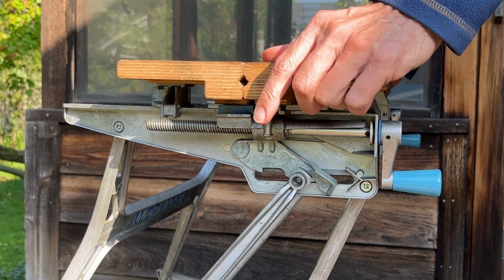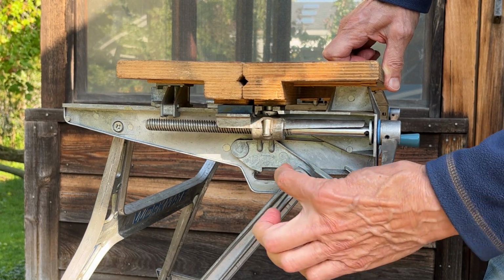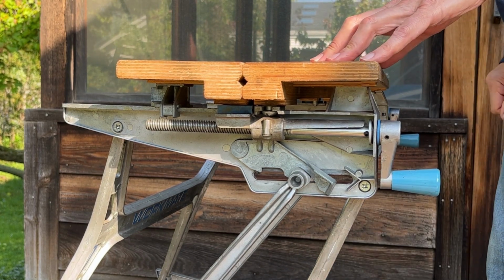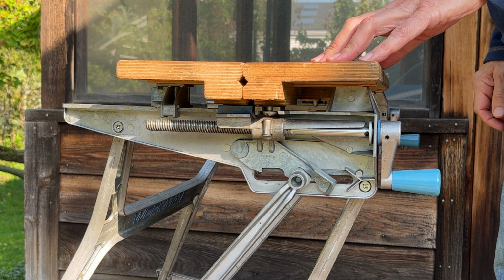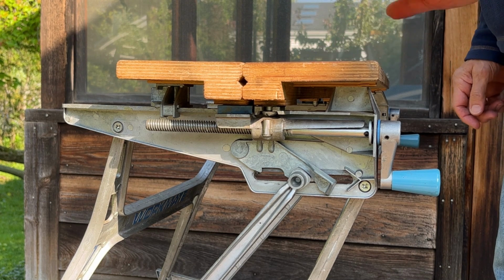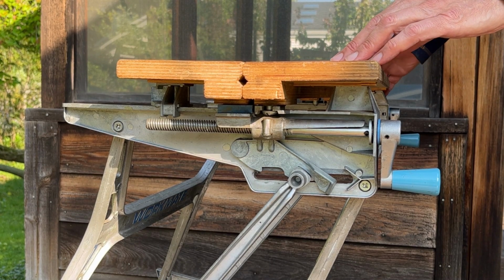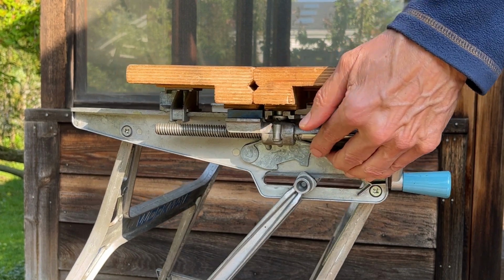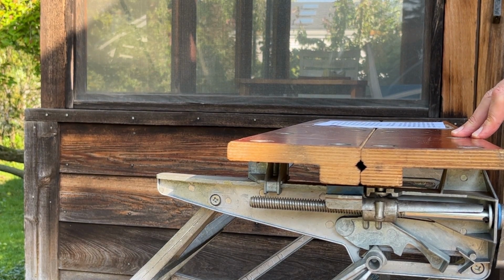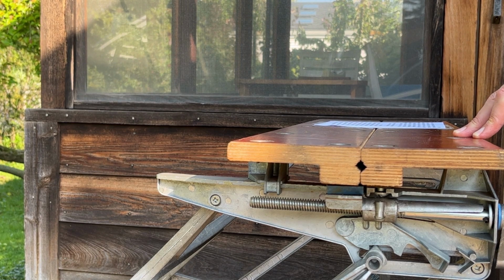It's right here, and in this position the top of the side strut falls into another portion of the latch. It seems reasonably secure to me, and I have actually tested it by sitting on the top of the Workmate in that position with no noticeable problems. I would recommend using that only if you really need it, and it's certainly at your own risk. The next position down here feels very insecure, and I agree 100% with Black & Decker. You should not leave it in this position at any time.